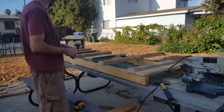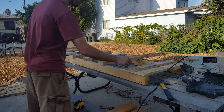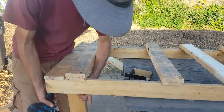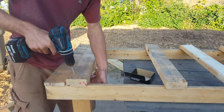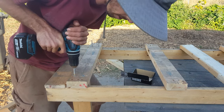Next I'll be putting in my legs, and I'm going to be putting them underneath the main edge 2x4. That's really easy because I can push it against this board and up against this board, and since these are at a 90-degree angle, my leg ends up at a 90-degree angle.